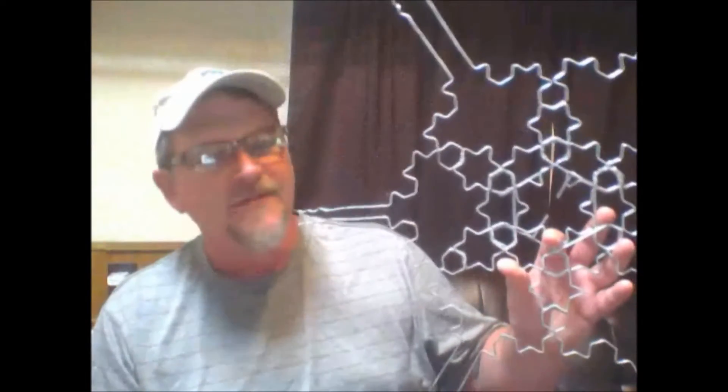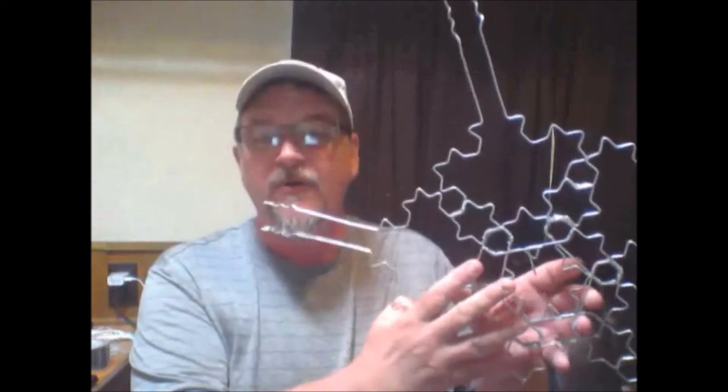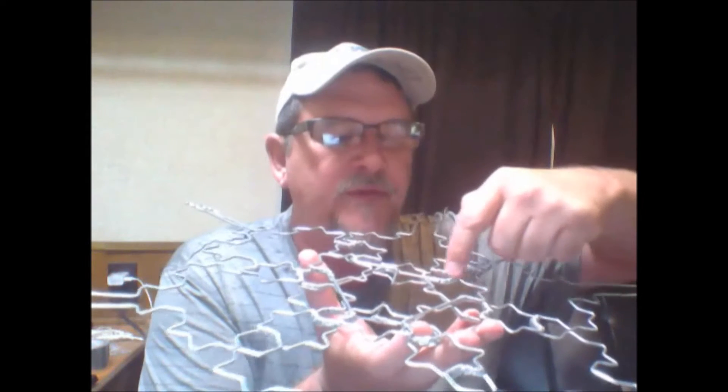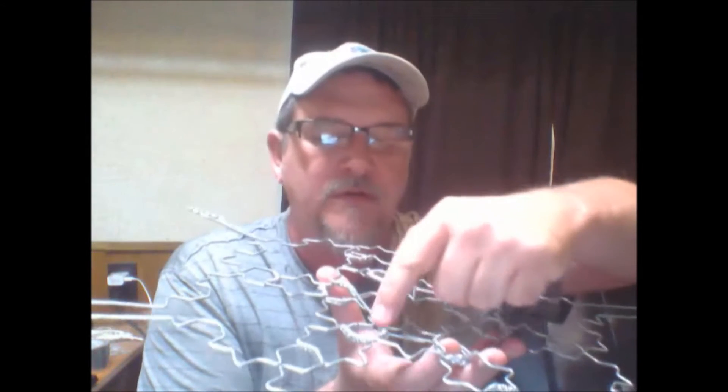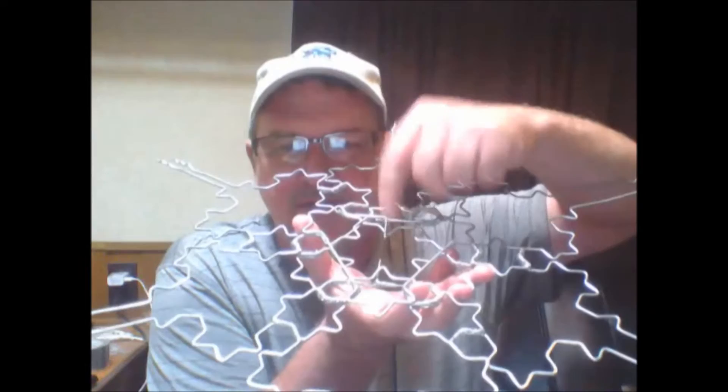I wired it together this weekend. There's no nuts, no bolts, no plywood — completely solid structure. Just to give you a little explanation of how it works: it is a dipole antenna. There's four layers on here. Basically, there's a half fractal which has got a three-star or nine-point on here — that's layer one. And it's got a terminal strip right there that my coax connector is going to connect to. One side of the coax connector will connect to that terminal.